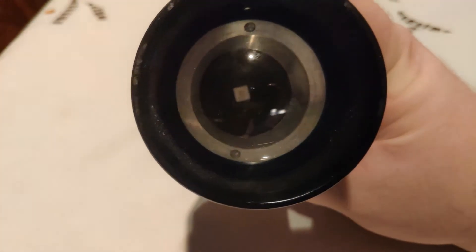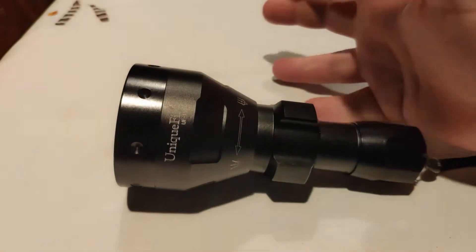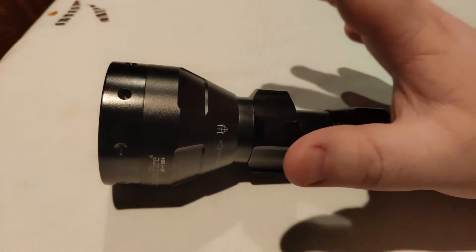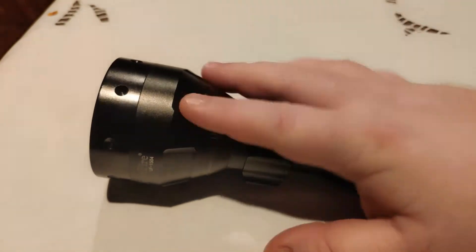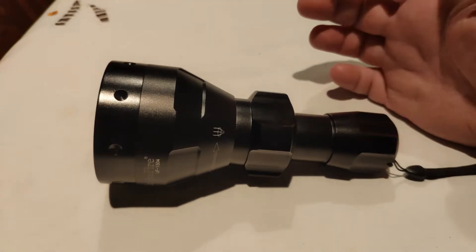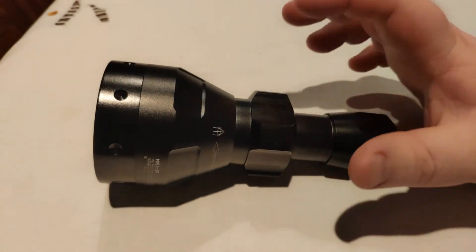So this has got the Osram in it - the Tiny W1, the 1mm by 1mm LED - in a Convoy 5-amp driver. That's pretty much what I wanted this for. It does about 650 KCD on my best output test, and it averages above 600 across all tests. It's a bit tricky to measure because I had to measure it about 10 meters back, and I was getting the best results the further back I went - anything below a few meters and the LED just looks fuzzy.